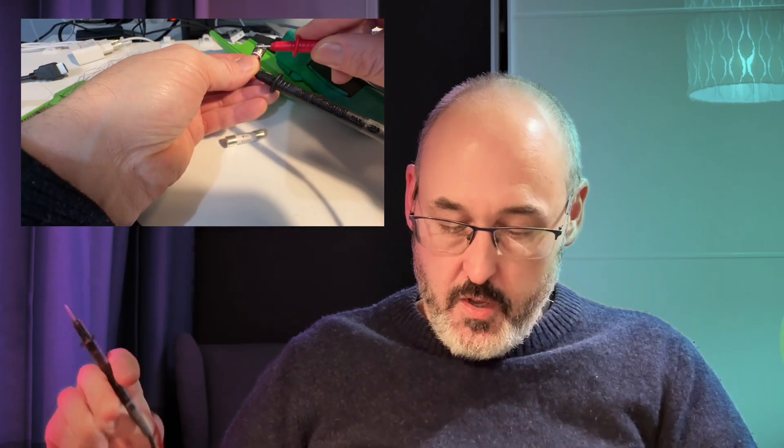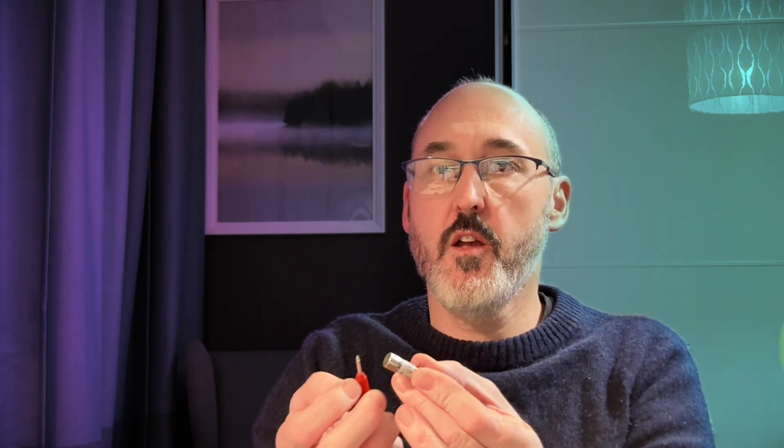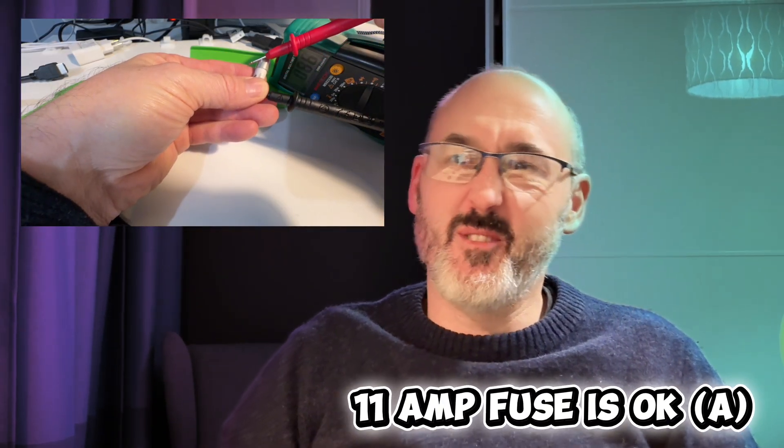And of course you can take the fuse out. The next thing to do, if you have got another meter, is the non-dangerous way: take the fuse out and do a continuity test across it. And lo and behold, there's no continuity — because the fuse has blown. Just place your probes across both caps, each end of the metal bit. Buggered. Do the same with the other one just to be sure. I tested this fuse at the time and it had continuity. This is the 11 amp fuse — the amp circuit, not the milliamp. Perfect continuity; nothing wrong with that one. So the amp circuit is okay, but the milliamp circuit had gone. There are the two ways of testing them.